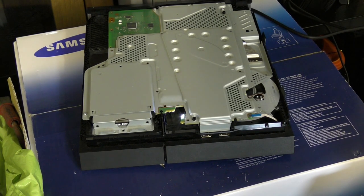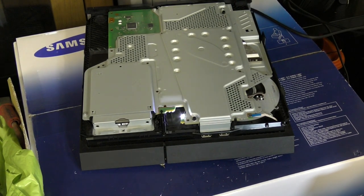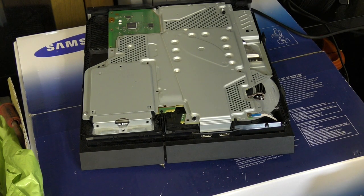So, there we go. It was indeed a case of just looking at what we know about the old boards and applying it to the new boards, even just a visual aid. You can see there that we found the same FETs, we found the same transistors. Knowing about where those signals come from is how we managed to deduce that there was a good chance that that portion of the board was indeed the bit we were looking for. We knew that that section of the board previously controlled the eject function. We followed that back to the PCI Express controller, which we also followed to the hard disk connector. On the new board, we followed it from the hard disk connector to the south bridge, which meant that we didn't have any sort of secondary controller in the way. We knew that signal had to come from Southbridge, which kind of chopped our balls off a little bit.